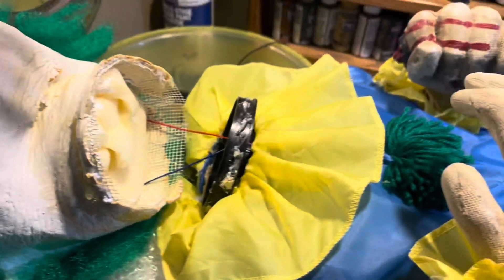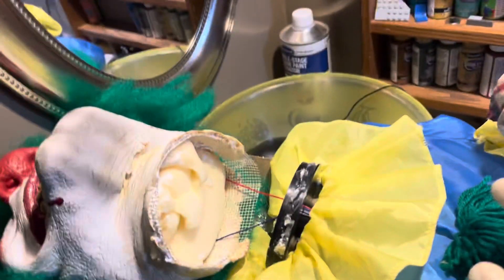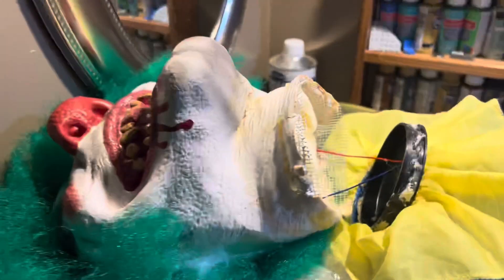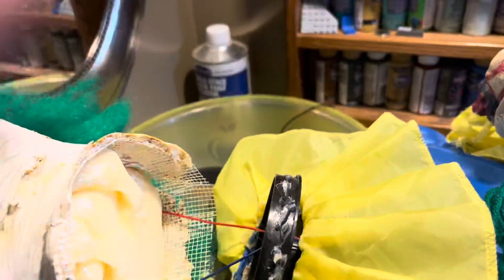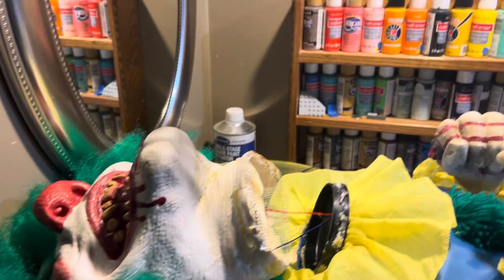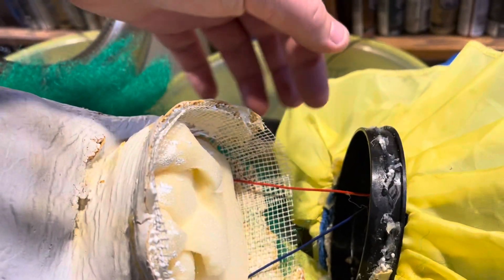The big problem is that his neck has come off of his plastic piece. What I'm working on now is I got some mesh that I've taken from my dad, and I'm taking some silicone latex caulk and I'm in the process of putting this around the head to try and reform what has been lost here — hopefully make it stable enough so it can just be caulked or glued in to this piece to last. Then what I'm going to do is take some contact cement and fill in all these gaps, especially back here — that's the biggest part I'm worried about.